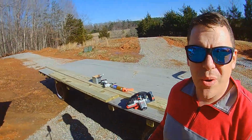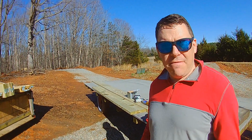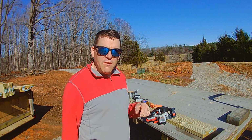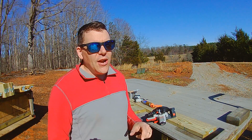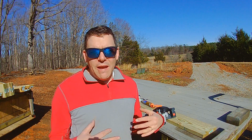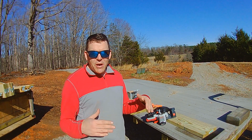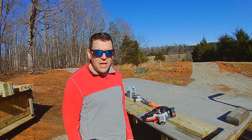All right, so to make these joists, I'm just going to put an extra half of a 2x10 that I have here on top of the seam between the other 2x10s. I'm gonna put a little construction adhesive over it, put in a bunch of screws, and hope that's good enough to create these joists. I know some of you will comment and say, no way, definitely not strong enough. But what I plan on doing, if this bridge looks like it's going to start to sag over time, is put some 4x4 posts in the ground in the middle and support it that way. But for now, I think I can just make it so that it goes straight across with these supported joists the way it is. So let's see how it goes.